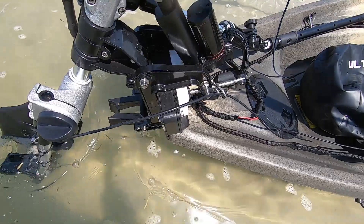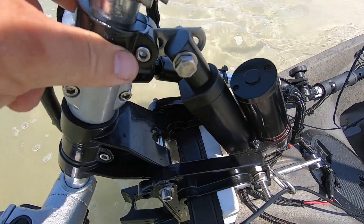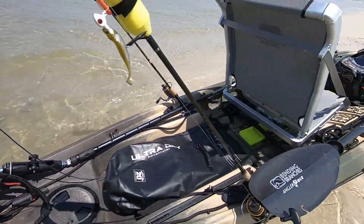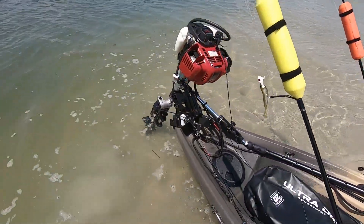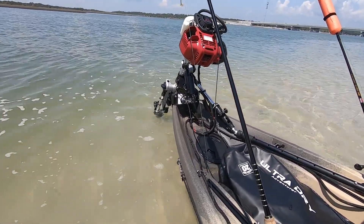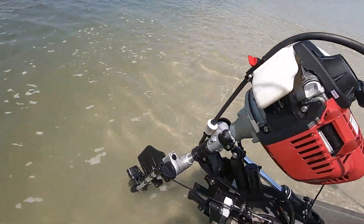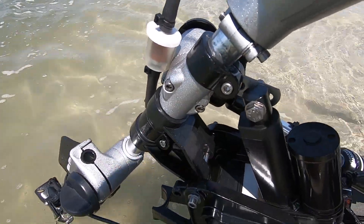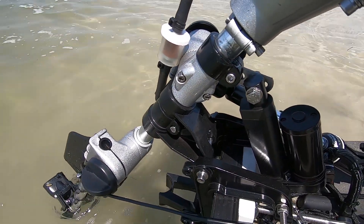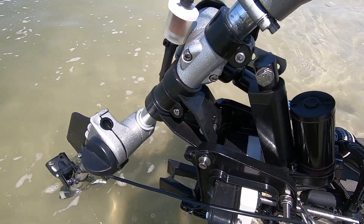The trim and tilt had to be customized on this bracket — it's really close to the edge and I had to grind a little bit here. But this floats, which allows the engine to turn while you're trimming. And again, we've got to be clear: this is not meant to trim the boat's hull, it's meant to lift it out of the water. This is a 2-inch actuator, so it will lock out at a certain point. This took a little adjustment — I had to learn where it needs to be, because you will break the mount if you pull it too tight. Don't want to stress it out, and you certainly don't want a longer one.